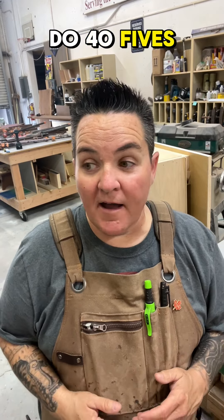A French cleat can hold a lot of weight, but that also means that you need to get your French cleat into the studs. To hang something this small that will be between studs, I only used one screw, but this is also a sample. If I was hanging an actual cabinet, I would use at least two screws in every stud on the wall member.